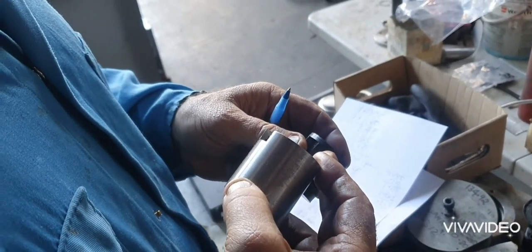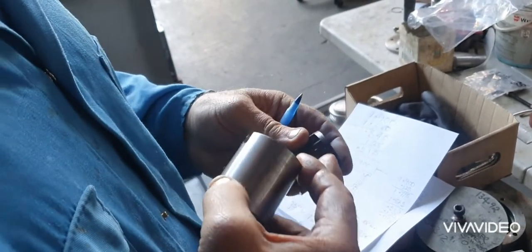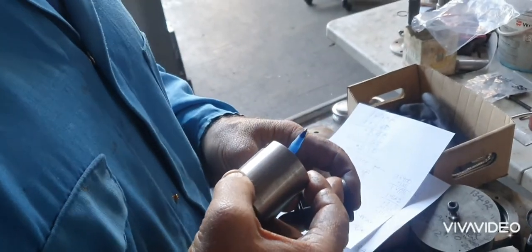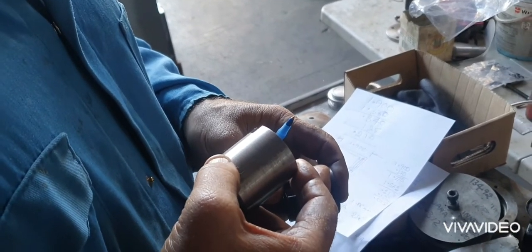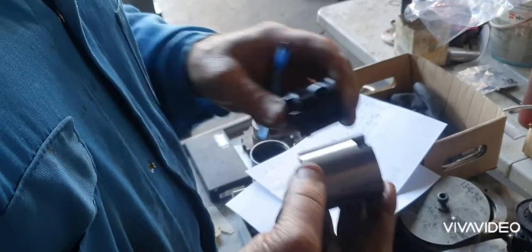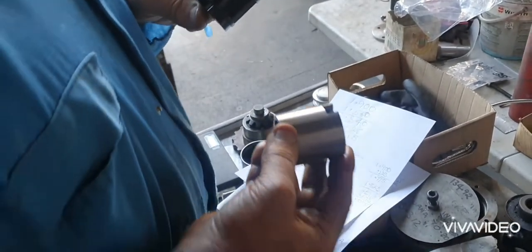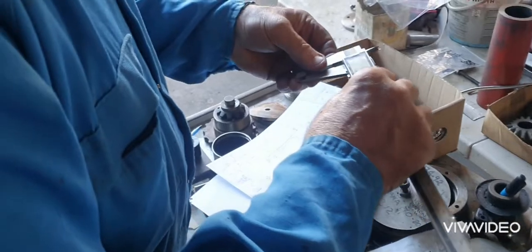Now what we could do, we could make the hole fractionally smaller so that the pins are pushing on this and not on that. You see, so if we made that, instead of 375, we could make it say 9mm, couldn't we? We'd get an 8mm end mill. And if we made it not 9mm all the way through, we just turn those bolts down from 3/8 to just fractionally under 9mm, is it?